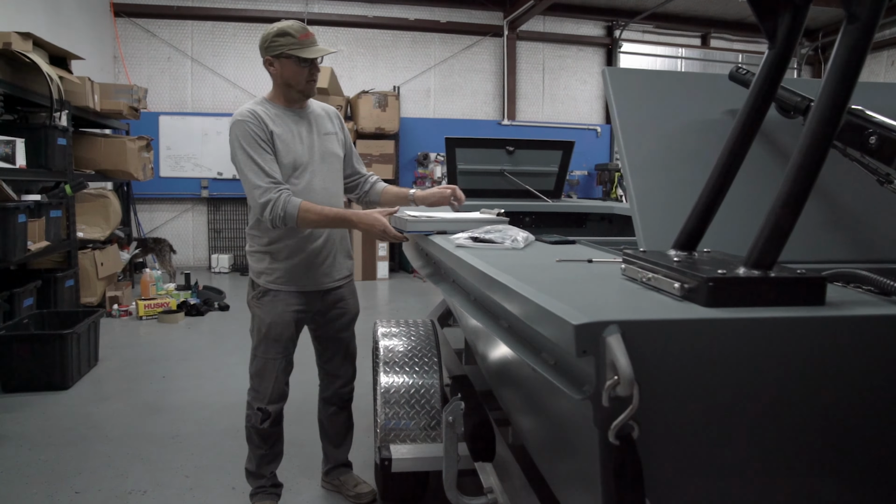His 5 switches will be here for your bilge, nav lights, cockpit lights, his bow spotlight, fuel gauge, and all bolted wires will be run in the tubes down through the floor channels into the rigging stage. This skiff is also getting Lenco trim tabs up here with tilt trim and jack plate switches. So he can run this skiff while he's up top, sit down, run the skiff while he's running up here, or run his skiff while standing at the pod console.